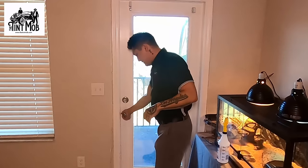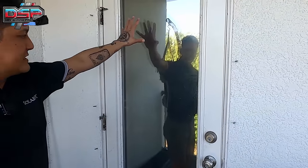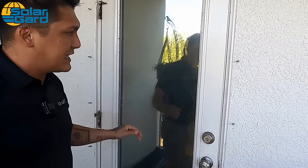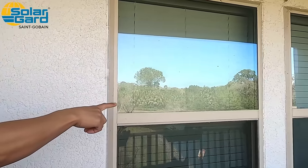Looking at the outside, this is a silver reflective mirror film. You're going to see some moisture pockets and some contamination — that's normal at this stage. You want to be standing six feet away from the glass when evaluating. If you can't see the contamination from that distance looking through the glass, it's considered acceptable. You're not going to have a perfect install — there might be a spec here or there. Good luck, hit up the comments below with any questions, and thanks for watching.